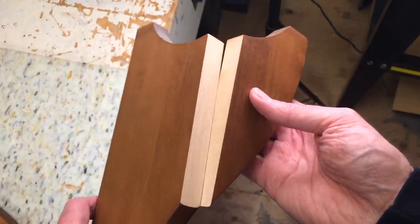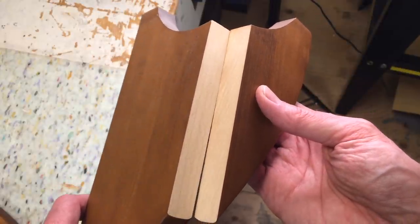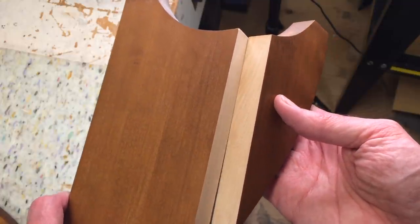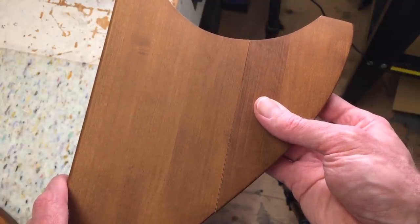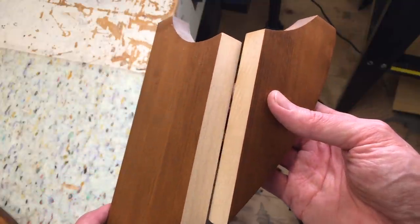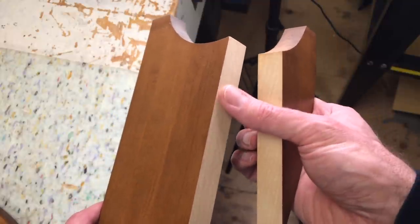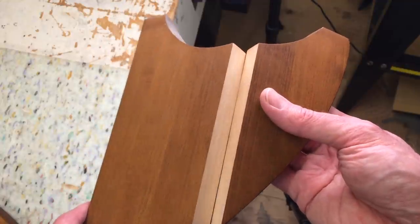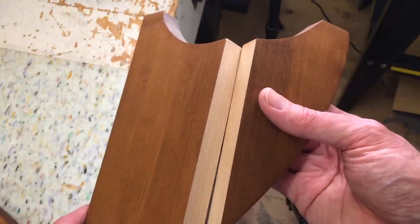If I put this in front of my video camera light, what I'm looking for is a sheen — something that indicates glue on here — but I'm not seeing anything. It's a nice tight fitting joint, so my guess is this failed just from lack of glue. I'll sand it just a little bit; I don't want to mess up the joint, just enough to make sure if there is any residue it comes off so it can be glued together.